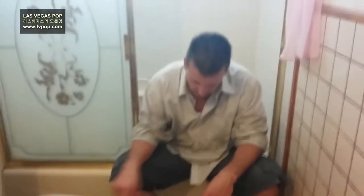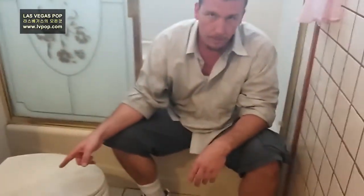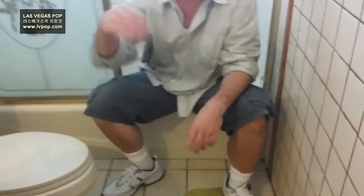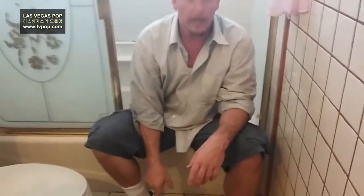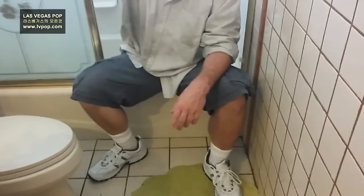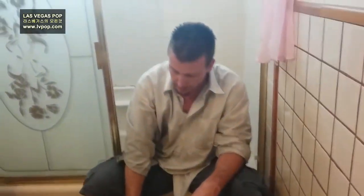Right now we're on the second floor. If you put silicone around there and that wax ring leaks — water and sewage have nowhere to go. It won't go out on the tile floor because we're on the second floor. The water is going to go between the pipe and the floor and it's going to go downstairs. Water finds the path of least resistance, so if there's no resistance, the water will go on the floor downstairs. Then you'd have to replace drywall, paint, whatever it goes on.